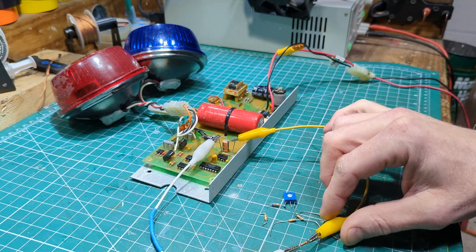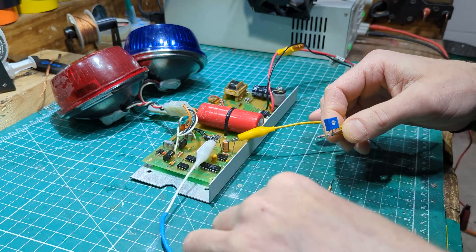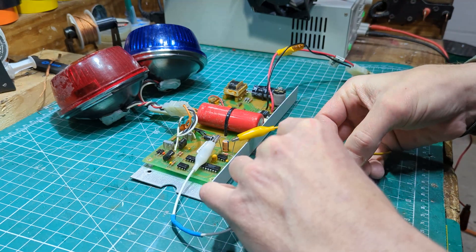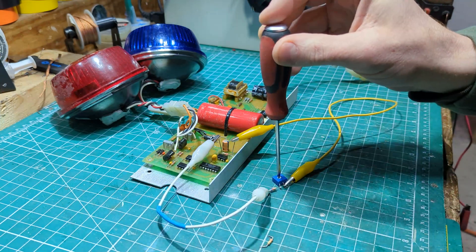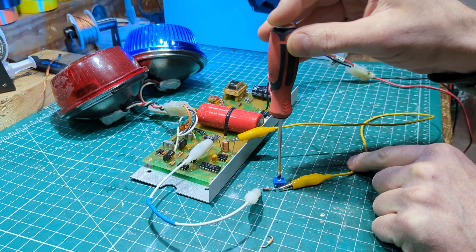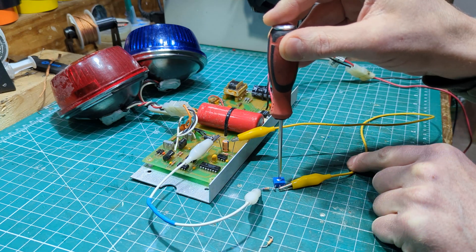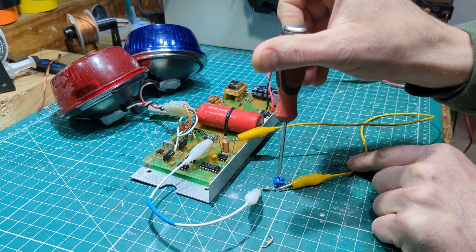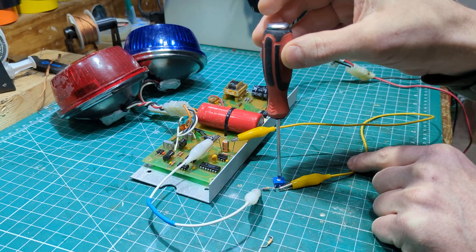Since they haven't promised a specific speed, no adjustments are needed when it leaves the factory. When we use the potentiometer, one of the things we want to do is take the absolute tap-out value — meaning at some point when your resistance gets too low, it will stop firing the waveform. So we tack a resistor on here that represents the least amount of resistance we can have and still make the device work. That way we're not taking the potentiometer below the minimum requirement. That resistor tacked on the end is a base lowest-possible level when the potentiometer is essentially letting through all current.